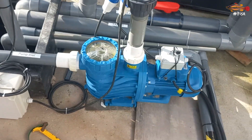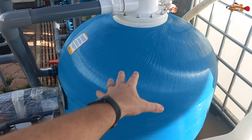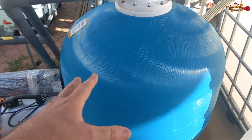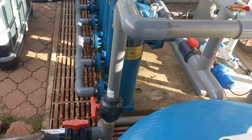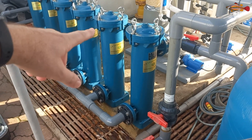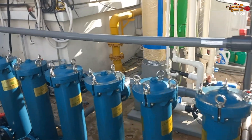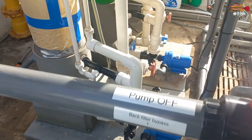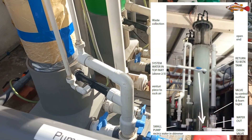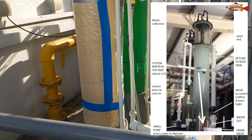From this sump we've got a pump that will push water through the different filter elements. One of the primary ones is this sand filter where we have glass chips on the inside. Then, because we do want clear water RAS for this experimental trial, the water will run through these cartridges that hold a bag filter — probably a hundred microns. Over here we have two protein skimmers. We can talk about protein skimmers in more detail, their functions, basic design, and how you can maybe DIY one.